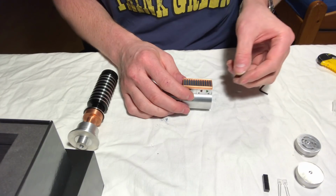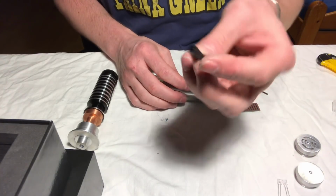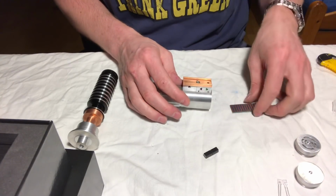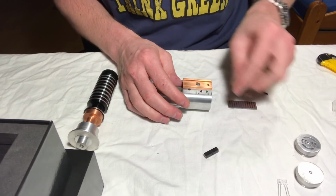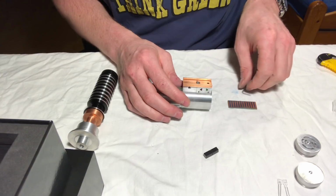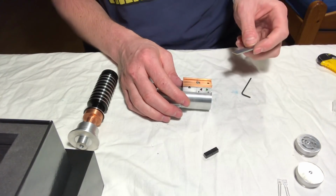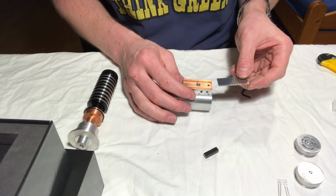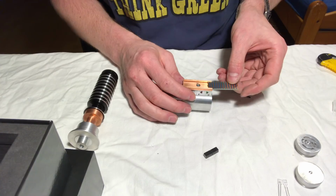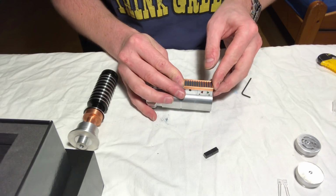So that's, I did forget one thing. So this piece, this black, this is your second switch. First switch being here. What this first switch is going to do is it's going to set inside that switch holder, and then it will stick out above here. The switches needed are simple 6x6 millimeter switches, 6x6x6, and the peg will stick out just a little bit, and then this will go on top of it, and there's a little bit of play in here for a reason.